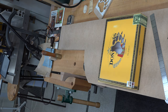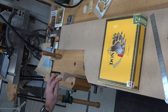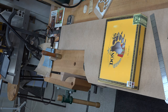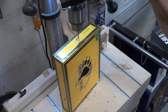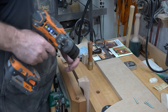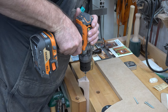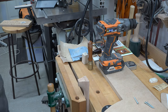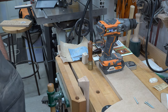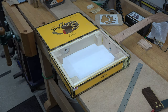We're going to drill pilot holes for some number-eight screws — probably a two-inch screw for the ones closer to the fretboard, and maybe an inch and a half for the back piece on the heel of our neck. Just be careful drilling these pilot holes to get them as straight as you can. Now we'll do a test fit by screwing it to our box. For these tight quarters, I think I'm going to use a bit that matches our screw size as well as a ratcheting wrench.